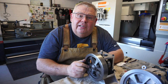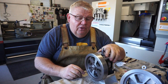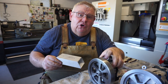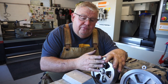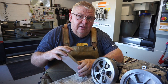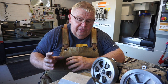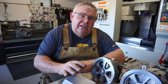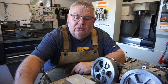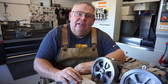That concludes the video today. I really appreciate you checking out my little Aaron Engineering channel and following along — if you made it this far, thank you. Now, for these bases, the motor is going to tip over so I've still got all this cast swarf from when I machined these, sitting in a clean bucket. I've bought some clear casting resin, I'm going to bung up the ends and fill the base up with a mix of cast swarf and clear casting resin. Hopefully that will give it a bit of weight and help absorb some vibration. I've never done it before so watch this space. Give the video a like or a comment if you can — have a lovely day, bye for now.